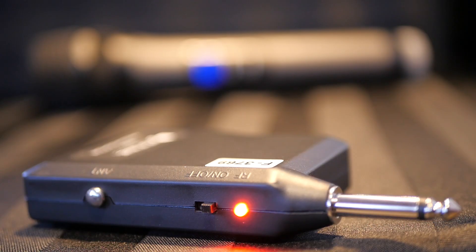The XLR part of the mixer is expecting to see a low signal that you can boost with the gain knob, and this is what most mics use. The quarter inch jack of the mixer is built for line level. The quarter inch jack from the K025 appears to be delivering a high-Z signal, which is more typical of an electric guitar instead of a line signal. To convert the audio signal into a signal more suited to a mixer, you can plug the receiver into a DI. This lets you plug the microphone into the XLR input of the mixer and gives the mixer the type of signal it was designed for. This will improve the high frequency response and even out a little bit of the proximity effect — which is what happens when, as you get closer to the mic, you get more low end. It will all around enhance the tone of the mic.